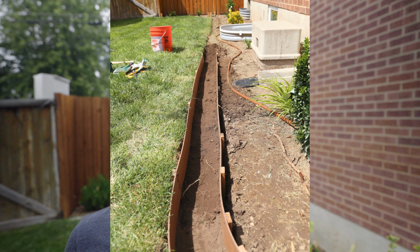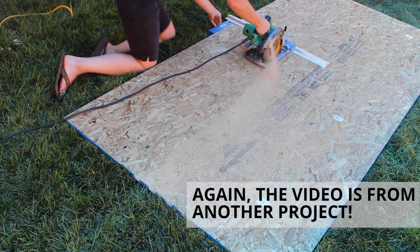Side note about the 1/4 inch sheet. I would recommend a 1/4 inch sheet only for angled areas. I used the 1/4 inch wood strips for straight areas but had issues with the form staying completely straight. I would recommend using a 1/2 inch sheet for the wood in these areas. I used a circular saw with a rip cut to cut the sheet. If you're not sure what a rip cut is, I will link to my post about using a rip cut for a circular saw in the description below.